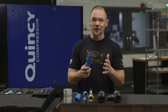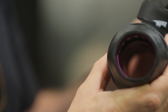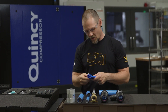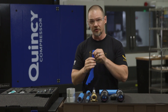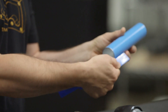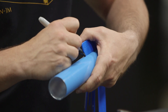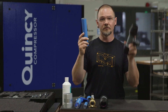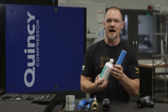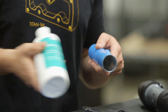We want to make sure when you put them in these fittings that they go in far enough — that's the key to its sealing. It's got to be seated against that pink O-ring in there. They give you these keys: you look up the size of your pipe. We're using one-and-a-half-inch pipe. Go ahead and put a mark — slips right on, like such. Put a mark. That lets you know how far the fitting has to go on. We're going to put a little contact gel on there to help glide past that O-ring. We're going to do whatever we can not to damage the O-ring — that's what's going to seal the pipe.